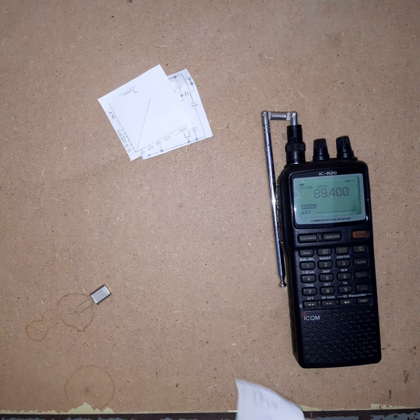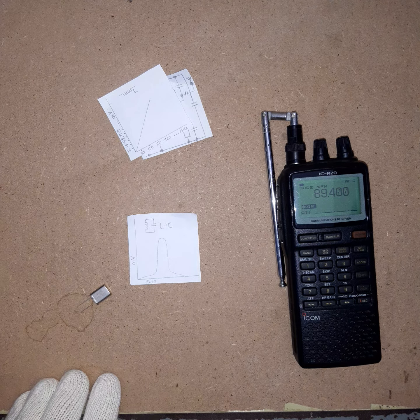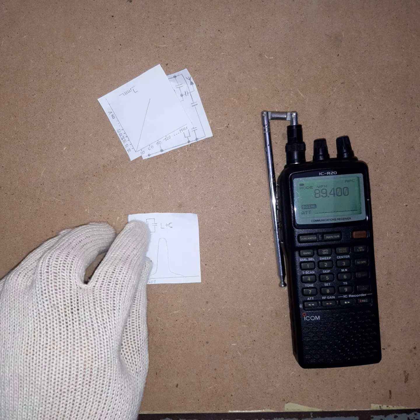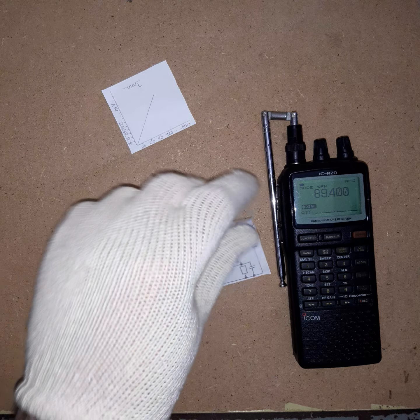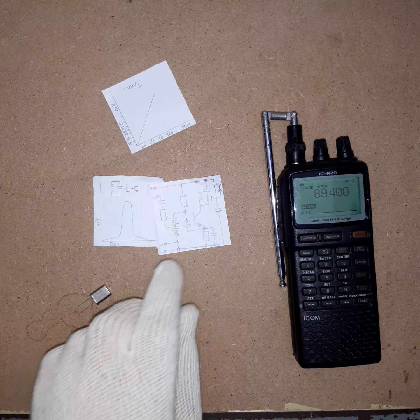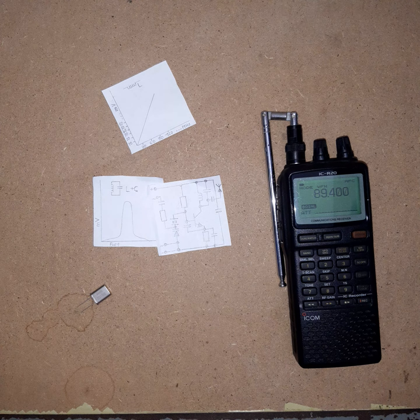People are even smarter and add a capacitor to the coil in parallel, and this forms a resonance circuit. With the resonance circuit, you can make a defined peak at a certain frequency, which depends on the value of the coil and the capacitor, to get out the signal that you want. And this is basically what people are doing. They are building a crystal oscillator, like let's say 10 or 20 megahertz, and then use a filter on the output and filter out the frequency they want.